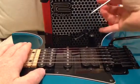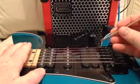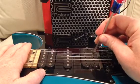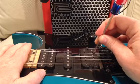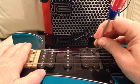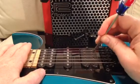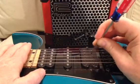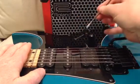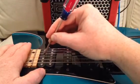So here's how you do it. If you want to know which coil is active, you simply select a pickup with the pickup selector switch — I've now selected the bridge pickup. With a small screwdriver, or anything metal really, you simply scratch — and I don't mean actually mar the finish, just rub the pole pieces on the pickup that you think you've got selected — and you should hear a signal. When you test the other pickups while you've got that one selected, they shouldn't make a noise when you scratch them.